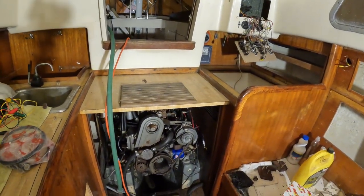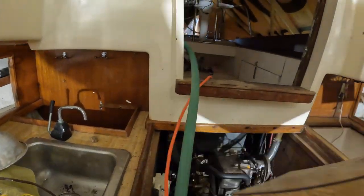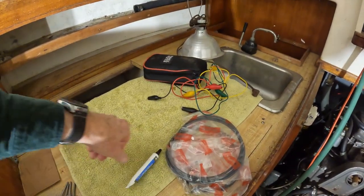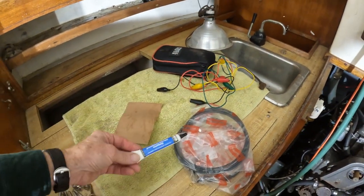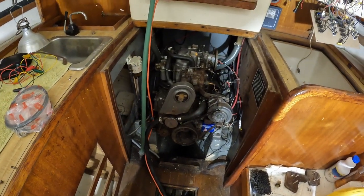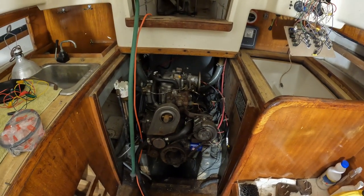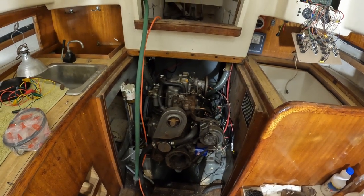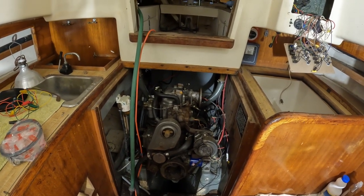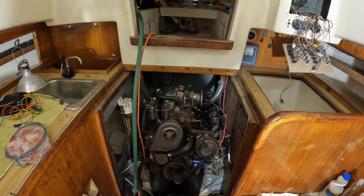Out on the boat now. I think what I'd like to do with the engine is check wiring first. I brought out some sandpaper and some dielectric grease. I want to pull basically every wire from the engine, sand them down a little bit, clean up the contacts, put dielectric grease on and put them back on — just to ensure there is a good contact for every wire going to the engine. That will eliminate any faulty grounds or faulty connections.